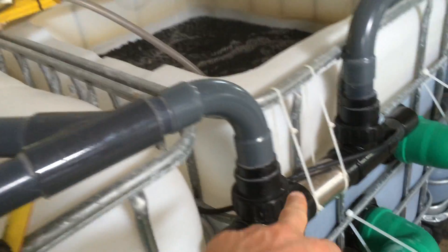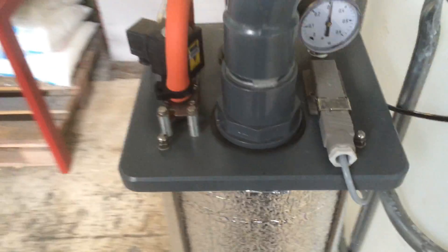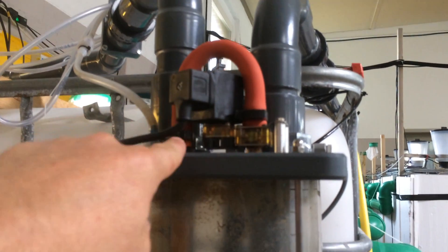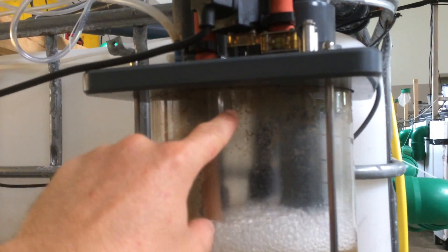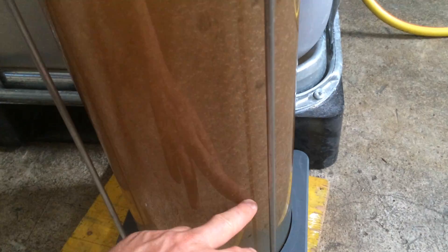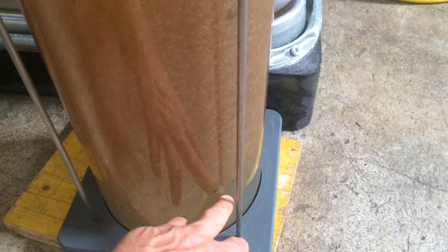Just get a quick bypass put in here — it drives straight to the heating element. The water is first pumped in through one pipe all the way down to the bottom. There's a slightly bigger pipe in there so the bubbles get blown through with the venturi. There's an electronic venturi here — we're pumping pure oxygen to the top. The venturi comes in with the water and makes it at very high pressure at the bottom. The small bubbles have to come back up again, and only small bubbles that are totally saturated into the water make it all the way down to the bottom again, because big bubbles rise much, much quicker. The very fine bubbles are totally mixed — like 300% saturated — and come down to the outflow pipe. Because it's under pressure it'll push itself back up.